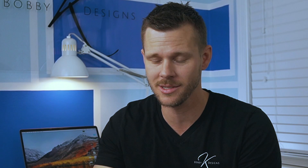If you know anything about installing pavers, you have to excavate down about eight inches. You've got four to six inches of compacted minus base, sand that's about an inch, and then the paver is usually two and five-eighths — comes out to about eight inches total. So there's a little bit more labor involved with this process.